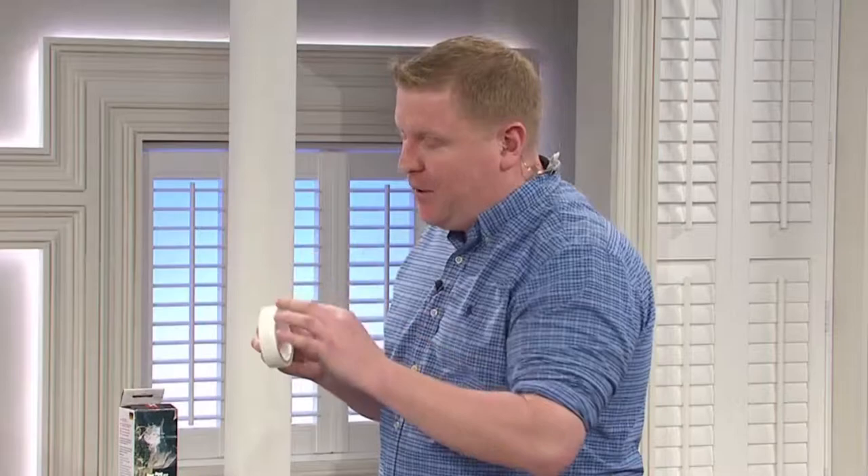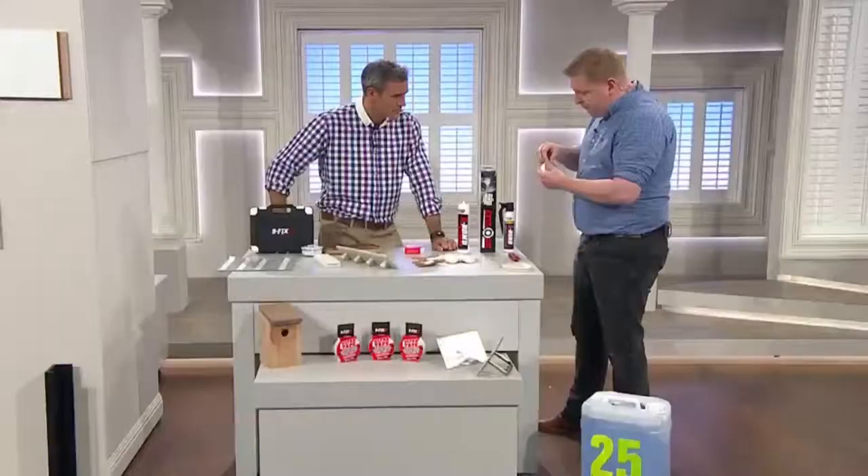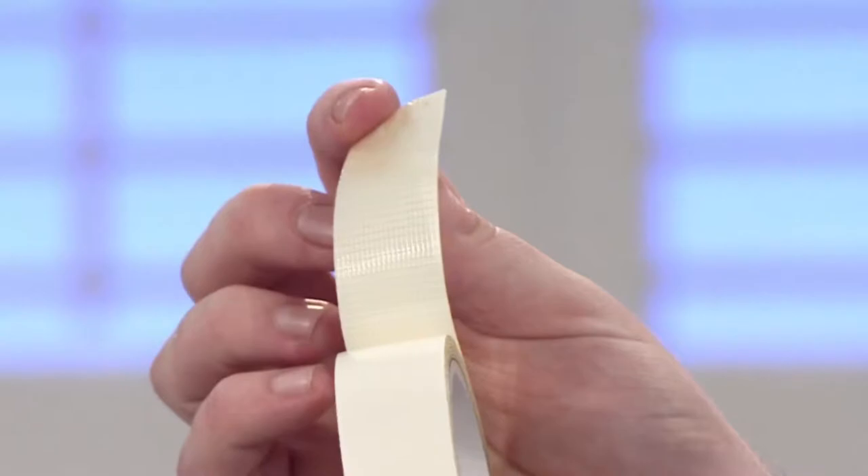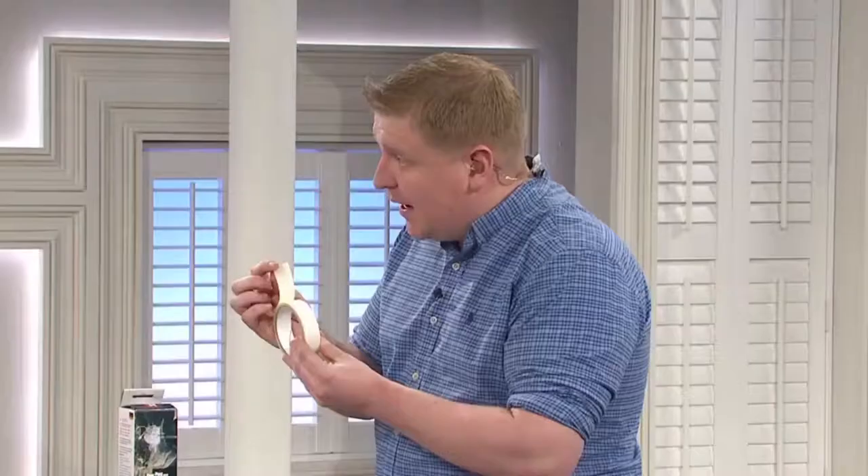Let me explain quickly how it works. It's double-sided tape that people have seen before. The difference with Ultratape is — I don't know whether the camera can pick that up — but inside the tape, we've actually impregnated fibres into this tape. If you don't do this and it's just clear tape, what happens is when you bond something heavy up over time, the tape starts to stretch and you can feel it slipping down. The fibres keep it together.